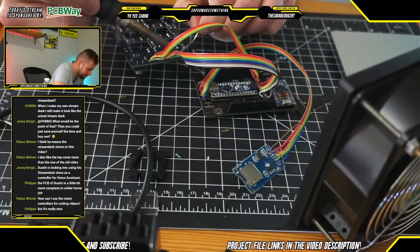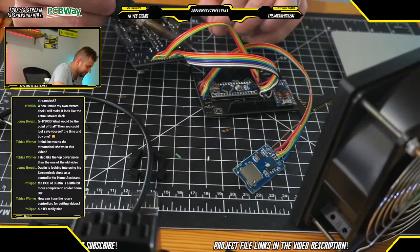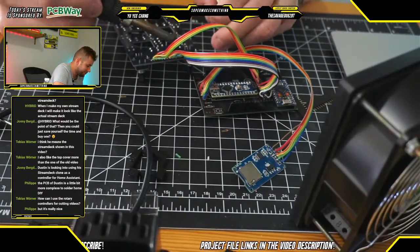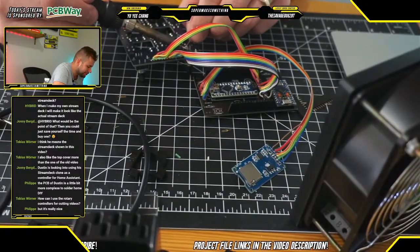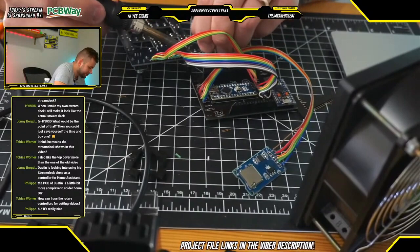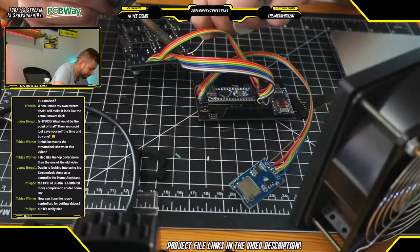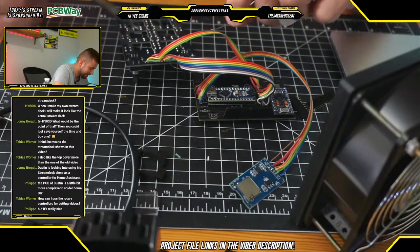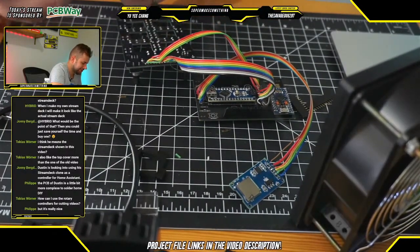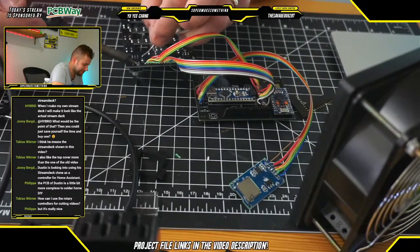All right, cool. And the way these connect to the circuit board is actually really interesting. And I guess it makes sense because these connectors see a lot of force, these rotary encoders. What happens is you basically, almost, I don't want to say weld because it's obviously not welding, but you basically dump a lot of solder into just some of the mounting holes just to make sure that it has a good grip. Then of course the communication pins are small. That's neat to basically use solder as a mechanical interface. I guess it's pretty common, but as a mechie, I always like to see where the electrical world and the mechanical world kind of collide, and where you can use the concept from one, like soldering electrical connections, into the other of making a good strong connection. That's cool.